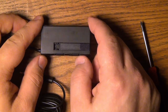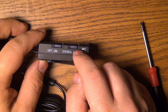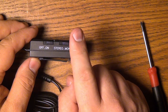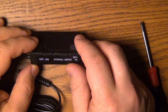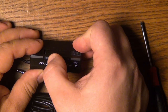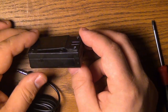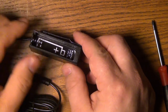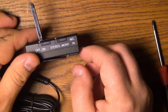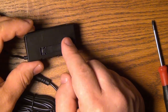There are not many devices like this out on the internet — unpowered electret microphones don't get a whole lot of love, so it actually took me a while to find this, specifically a stereo version. There are a bunch of mono versions but stereo doesn't get any love. The case it comes in is reasonably decent — you have an on/off slider switch over here, a mono/stereo switch, it uses a single AA battery with a little compartment that pops open, and it has a belt clip. There's also a little arm on it whose purpose I have no idea, as this didn't come with any manual.